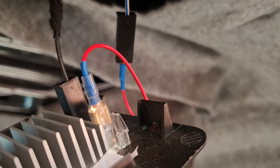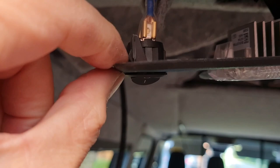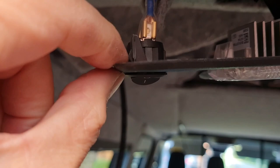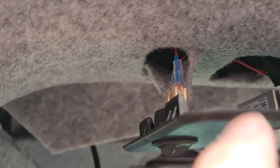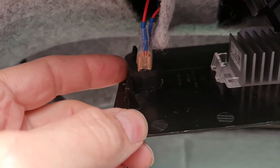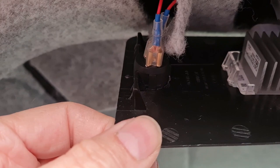So now what I'm going to do is cut a hole here. As you can see, the switch has to be mounted quite close to the actual edge, because it's got to fit into this recess here. This is a solid piece so things have to fit quite tight to this side. You will need to mount the switch pretty close. There are two lugs here which are fixing lugs. I put a washer between mine so I could get an idea where the center was, and then I just drilled through it using an 18mm drill to cut the hole for my switch.